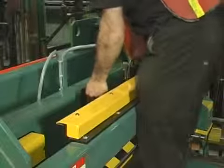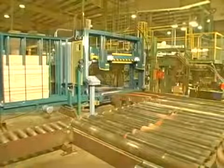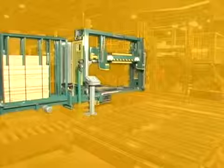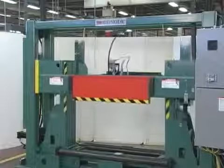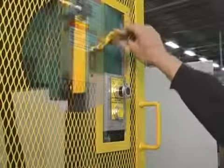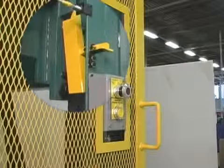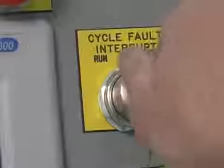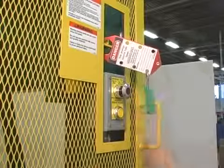Before servicing the machine or walking on conveyors, follow your plant's procedure for locking out power to SIGNODE's Z30 MP2 equipment and all adjoining equipment. Lower the platen to its lowest position, or raise the platen to its full upright position. Engage both of the platen latch pins. Lower the platen onto both platen latch pins. Put the machine into INTERRUPT mode and follow your plant's lockout tagout procedures for securing and isolating all power sources.